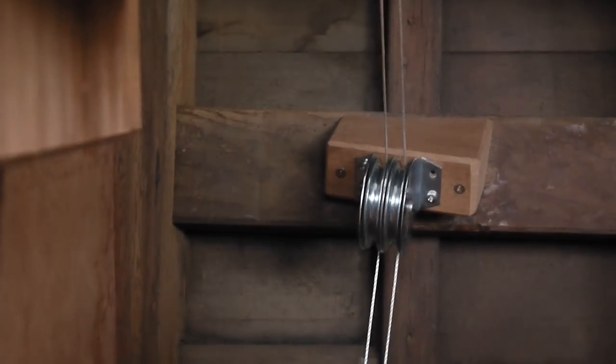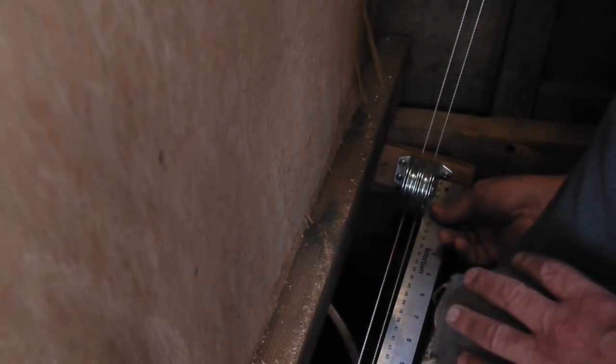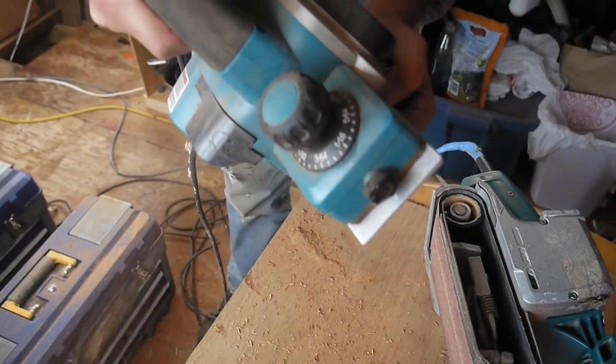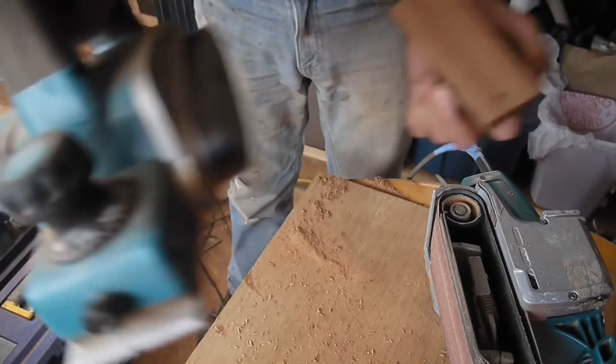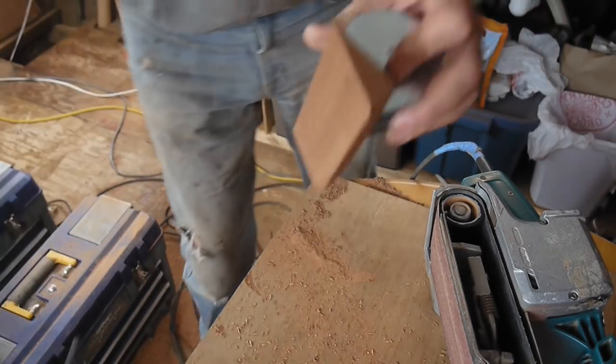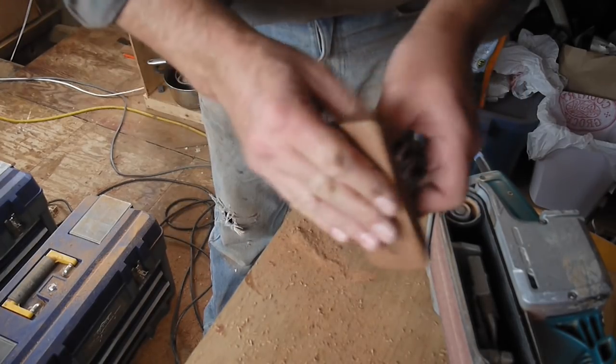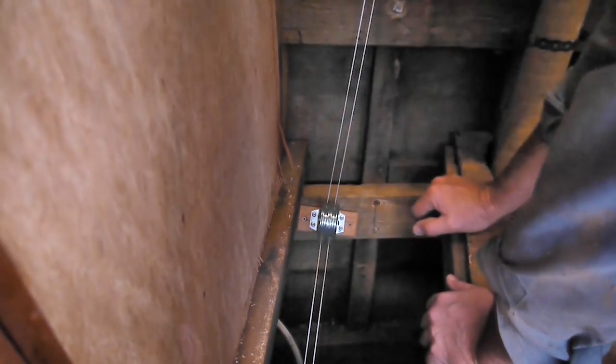Let's look at the lower one here. My gosh, that's pretty close - it's off by a hair. But I can easily take that into account, and in the other direction it's basically right on. This one's a pretty easy scribe because it's not that severe, so I can actually just use the pin sideways here. I'm going to stop about there because I'm pretty close, and do a retest fit. So pleased - we're all done. We have perfect alignment right through the system.